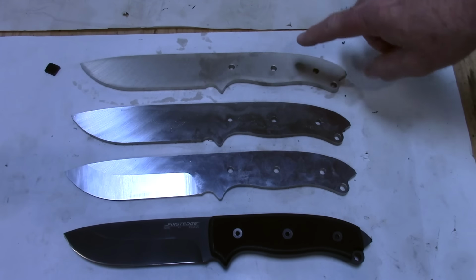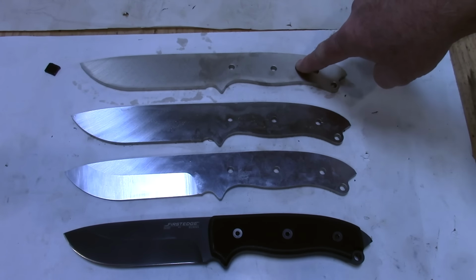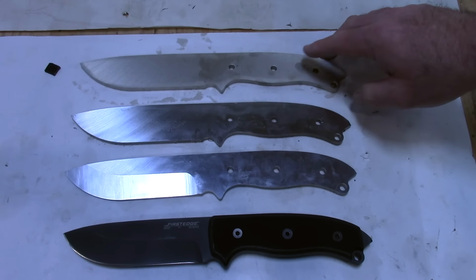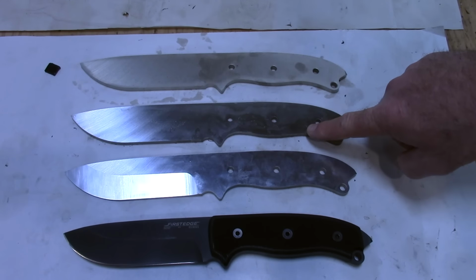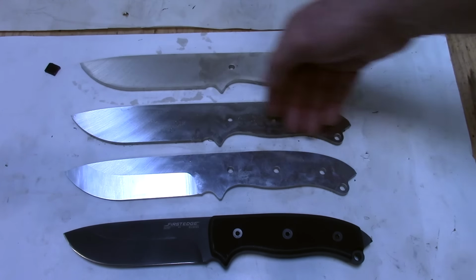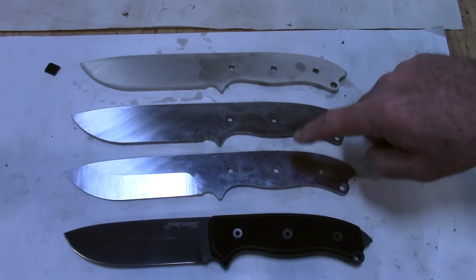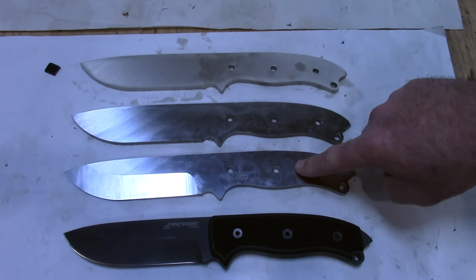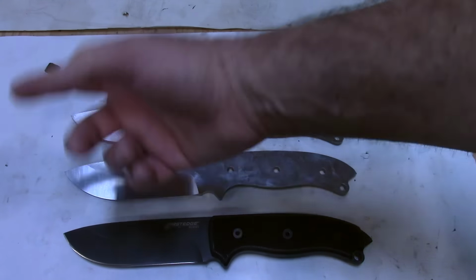So this blade at the top, as it just came out of heat treat, it's been rough ground, CNC'd the profile and the holes. We then come in and do a finish double disc grind to get it down to thickness, take off about 15 thousandths for a clean finish. Then from double disc, it goes to the flat grinders, and from the flat grinders they get tumbled, and then they get blackened, assembled, and edged.